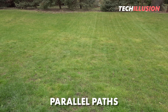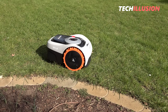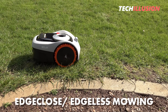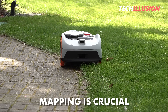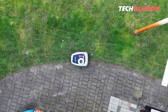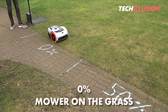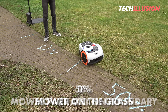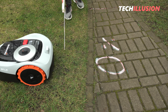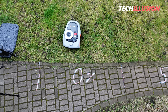This double security means the lawnmower does not accidentally land in the flower bed, enables consistently good parallel paths, and precise mowing of the boundaries. Regarding the cut-to-edge function, the lawnmower has two options: edge-close and edgeless mowing. During mapping, we tell the lawnmower where it's allowed to drive along the lawn edge. This can be activated or deactivated in the app. I conducted measurements at 0%, 50%, and 100% overlap. At 0%, the mower leaves a distance of about 20 to 30 centimeters to the boundary.